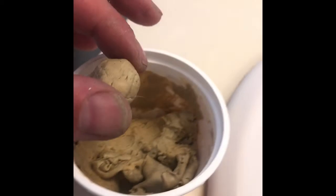That was around the rim top. And you just want to go ahead and remove that. Put it back in your plumber's putty. And let that sit for 5 minutes. And check for leaks.